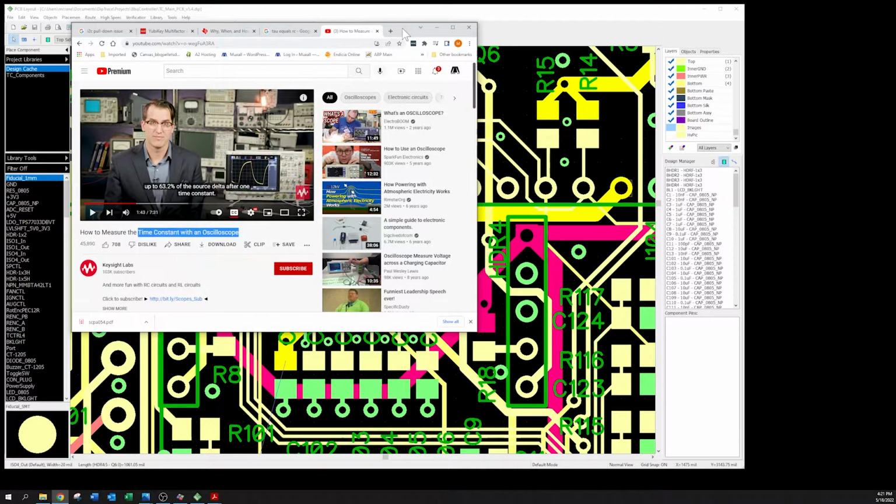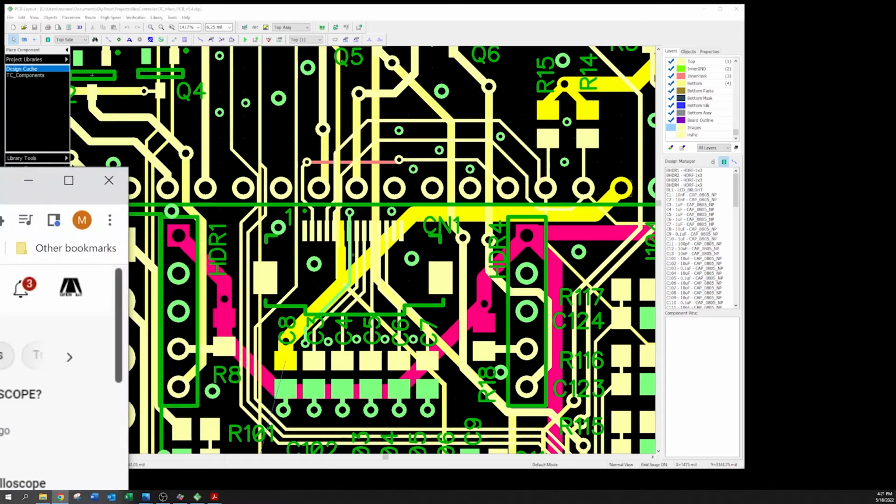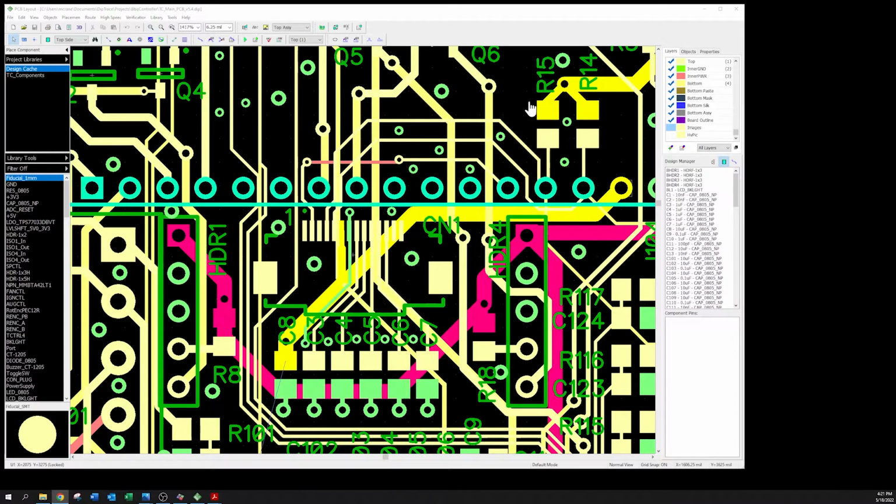And let me back up a little bit. I think I got ahead of myself. So we know the resistance of these resistors right here, right? These are like 5K or 5.1K or something like that, pull-up resistors. And there's also a built-in pull-up that's a very weak one on the ESP32 that's enabled by the Wire library I use for the I2C. And Espressif, who makes the ESP32, said that the internal pull-up's around 50K. So it's very weak, and it's inside the chip.